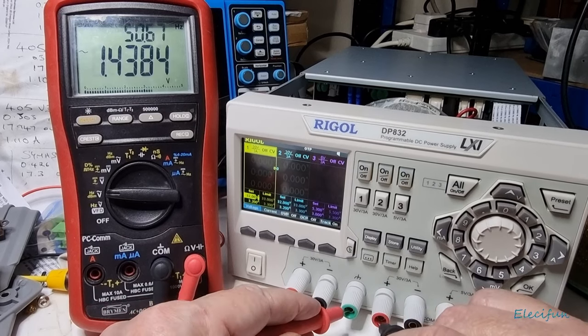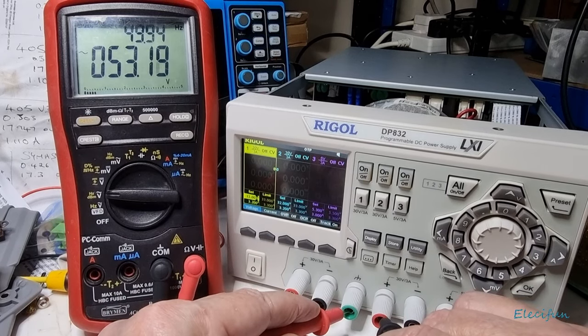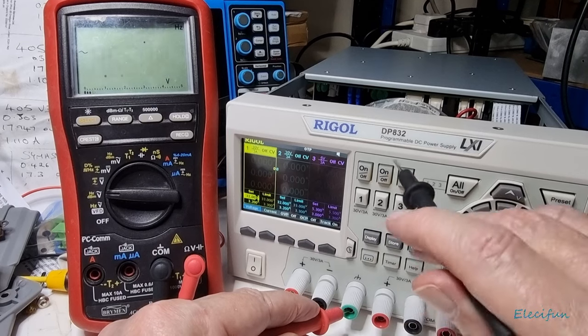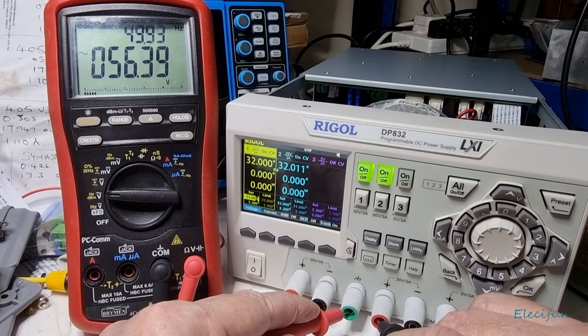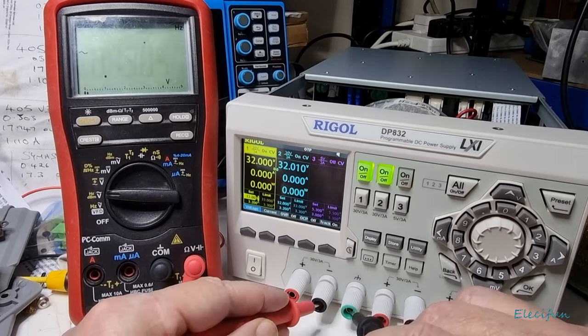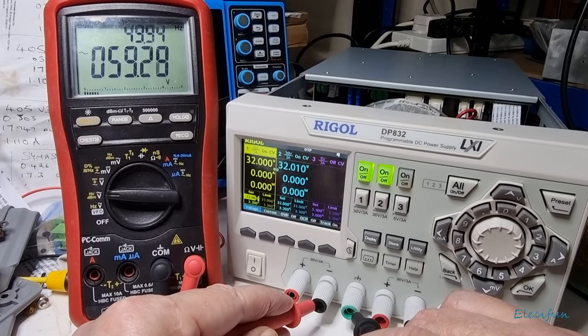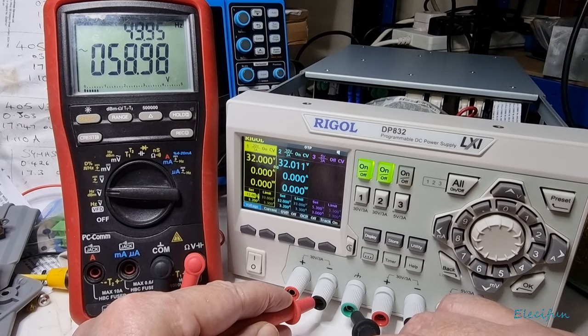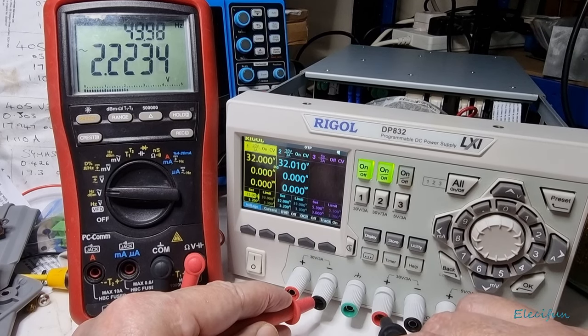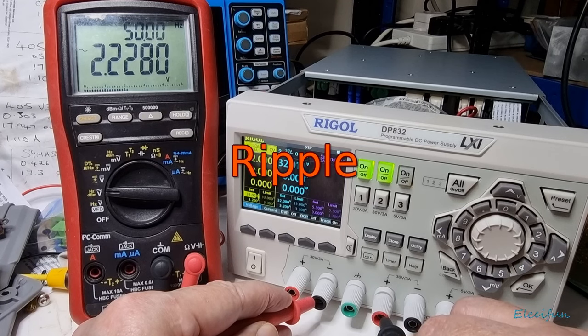If I change this around and go from here to here — 53.1 volts, not far off. And with the power on — 56.4 volts. I think I've found the problem: 59 volts AC. Let me just put that across there again and we've got 2.2 volts AC as our output. That would be a lot of noise — that would be a lot of noise.